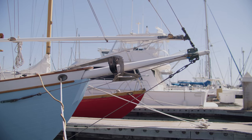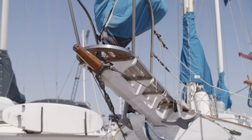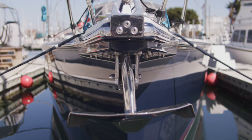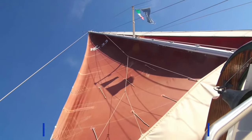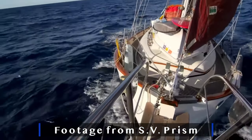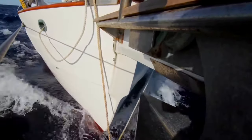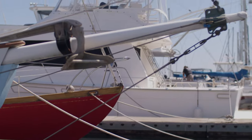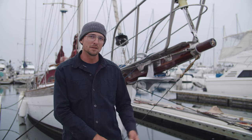So let's start with: what even is a bowsprit? A bowsprit is a spar coming out of the forepeak of a boat. The reason they did this back in the day — and still today — is to give more sail area out of a smaller boat. Even though this is only a 43-foot boat on the water, it's 50-something feet overall, giving a lot more sail area. There are a lot of forces going into this bowsprit — you can think of it as a compression post sideways in front of the boat. It's crucial that the structural integrity is sound to prevent catastrophic rig failure. As legendary riggers will tell you, your rig is only as strong as your weakest link, and in this boat's case it was the bowsprit.